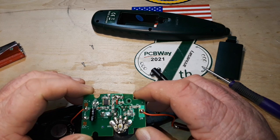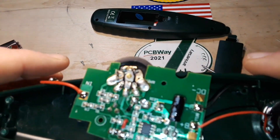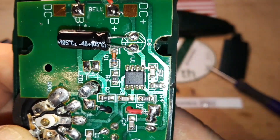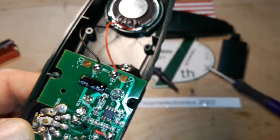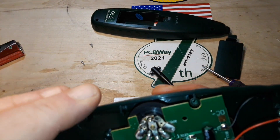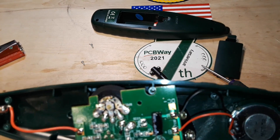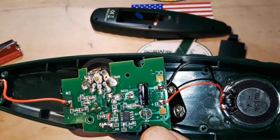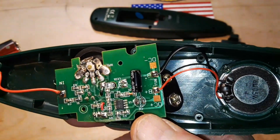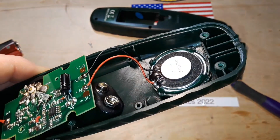And that chip is an LM386, a simple audio amplifier. So our signal is coming in, going through a capacitor and resistor, then through a leg of that JFET, coming out through another capacitor up to the LM386 where it is being amplified to audio frequencies. The DC is coupled out with this DC-blocking electrolytic capacitor, and the resulting AC signal is delivered to your ear via the little speaker.